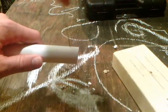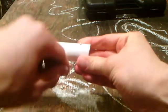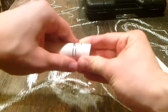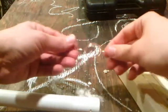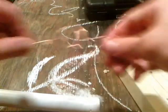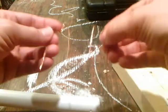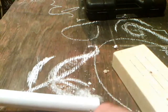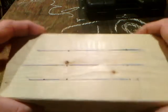To begin, the bare copper wire was wrapped around about a one-and-a-half to two-inch diameter PVC pipe, and we wrapped it about three times around. This is a rough example, and then you have your finished product. Next, we took some of the bare copper wire and bent them into M shapes — these are the supports that the coil will ride in. Finally, the base that those supports will fit in is this piece of wood, and we've drilled four holes into the wood in order to support them.